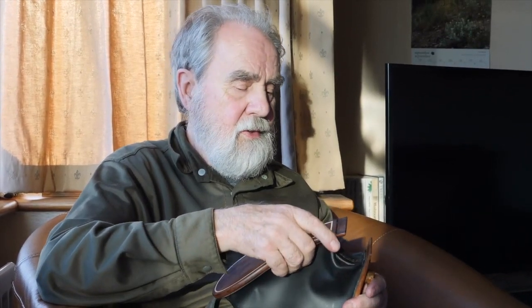Yes, especially when I'm putting these plates on here. I cut the ends off the screws so they're a bit shorter. And when I drill the holes in here, I have a stop on the drill that only allows the drill to go almost through, but not. Otherwise, you tend to get rows of holes on the side. It happens, but not very often, because I've got a good stop.